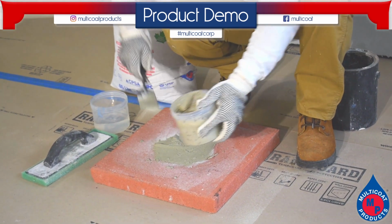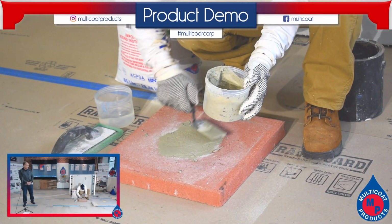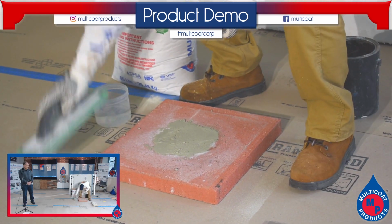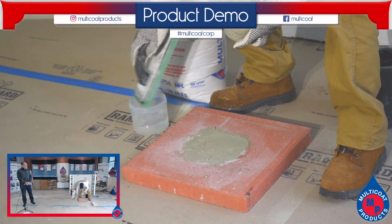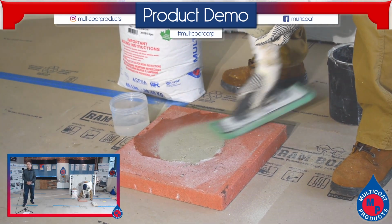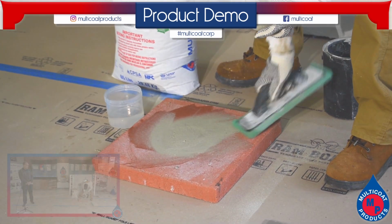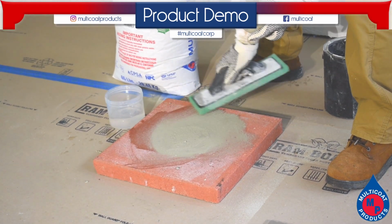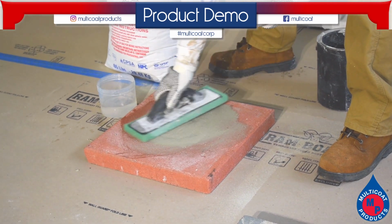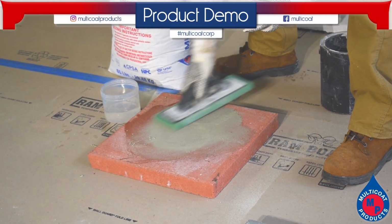It is great for pool repairs, pool decks, driveways, sidewalks, any kind of concrete. My only recommendation would be to always do it in small quantities because it sets up so fast. If you mix a large amount, it'll probably set up too fast on you. So work with it in small quantities. As you can see, Alfonso there is kind of feathering it out so that it finishes as a smooth surface on that concrete.